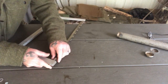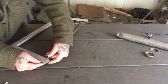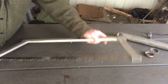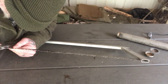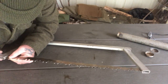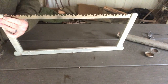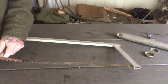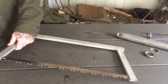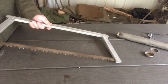You get that hole to line up and come through, then you can get your washer and nut on there to start tightening it up. It's a pretty tight fit — you can barely grab those threads — but once you get a hold of them, there's actually a slot beside the hole so you can pull the blade into the slot. You just have to line it up as you do it, and you have to be cognizant when lining this up to pull it into that slot. But once you get that done, you can get all the tension on it you want — it's a very stable design.